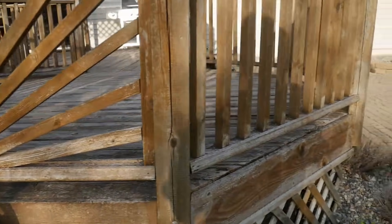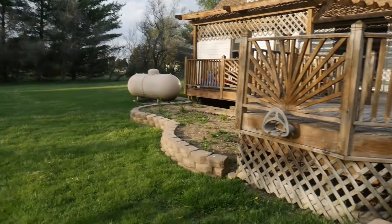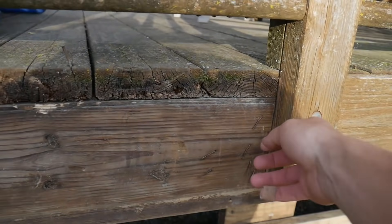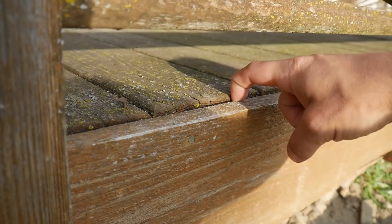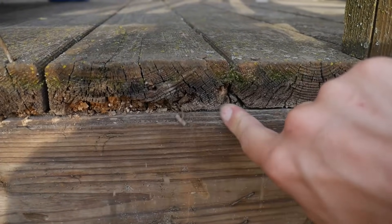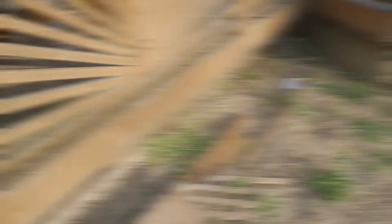Another starburst that isn't even together. The whole thing is sagging a little bit on this side because the sump pump used to discharge right here — it now goes out into the ditch at the woods. You can see we pulled off a piece of fascia board which was held on with galvanized nails again. How is it a good idea to leave an area where you can't get any sealer in on a pressure treated deck? You can see how all of this is completely rotting away because water pooled up right here and had nowhere to go. We're going to change that.